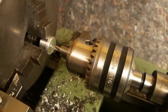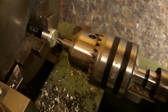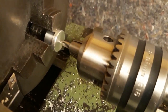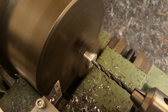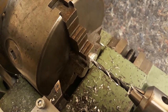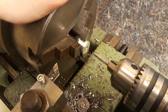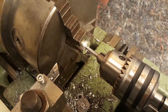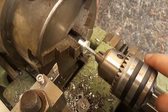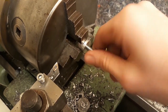That's nice. I've got the part flipped around and cleaned the side up, and I'll just do a little center drill for the thread. All right, now there's the hole for the thread. Nice, that should work just fine. For the thread I've just got the tailstock kind of floating here - just press this on, then just start cutting the thread and the tailstock will just move the right amount by itself. Yeah, that's working just fine.